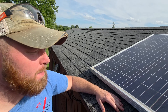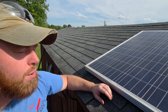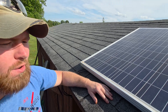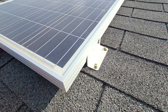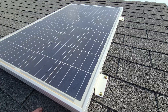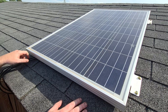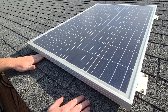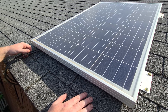The first part of this is obviously the panel. This is a Renogy 100-watt panel. It's pretty small and super easy to mount. It's got four screws that secure it into the roof — little brackets and four little screws that go into the roof. It took about five minutes to put up on the shed roof. It's got two plugs on the back of the panel that your two wires connect to. There's a little gap under the panel where the wires can run down to your solar charger.